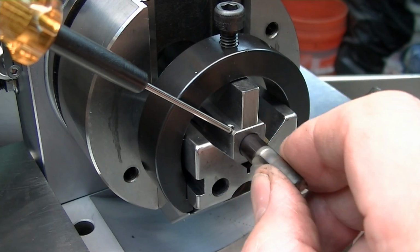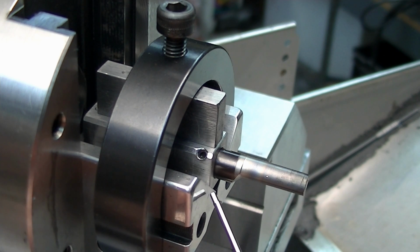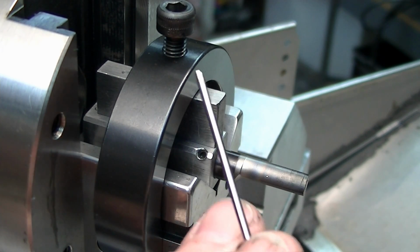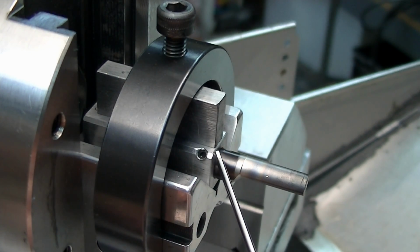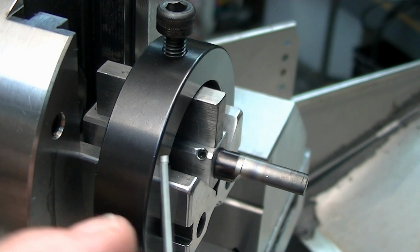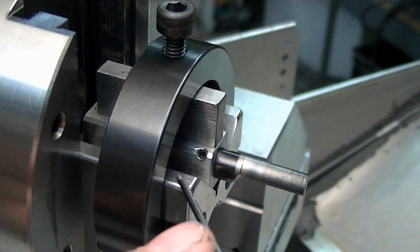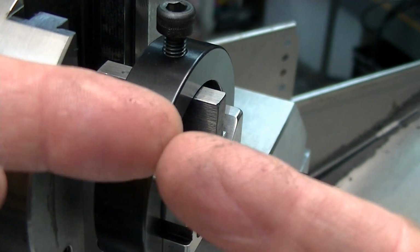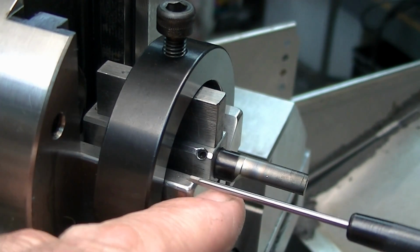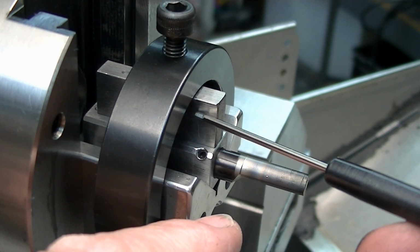repeatable location block for these tools mounted in the punch grinder. Just a few points about V-blocks in punch grinders and V-blocks in general. You'll notice that this wall thickness right here is very thin, so if I just ran that screw down on this, several things would happen. Number one, I could actually collapse the wall here if I tightened it too tight, and this wouldn't fit in anymore. Also, this would have a tendency to spring up on each end and press down in the middle, just because of the nature of everything acting like rubber. Press down here, this is going to do this, and that's also going to influence the axis of the part out here. So a spreader block like that is always a good idea, no matter what you're clamping.